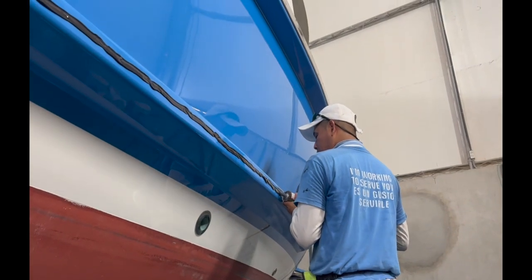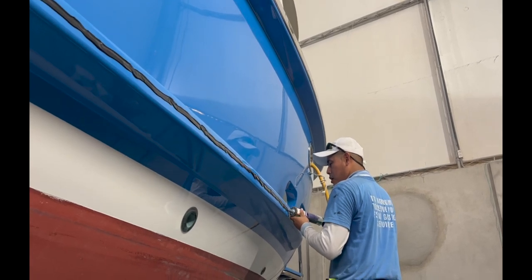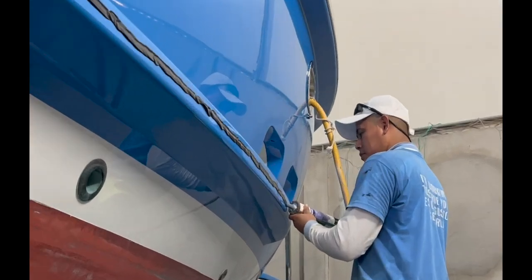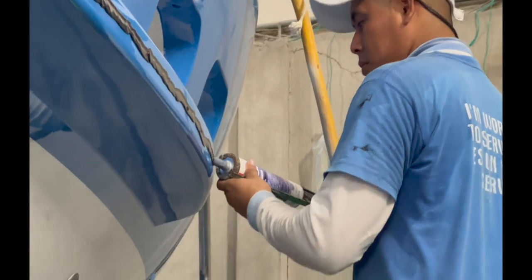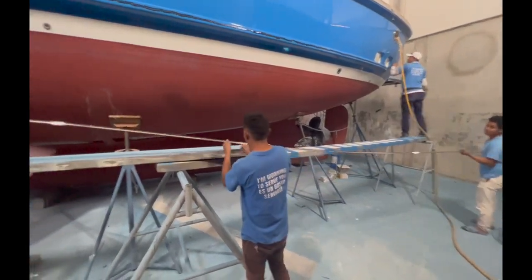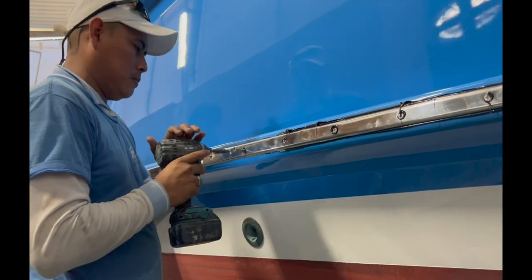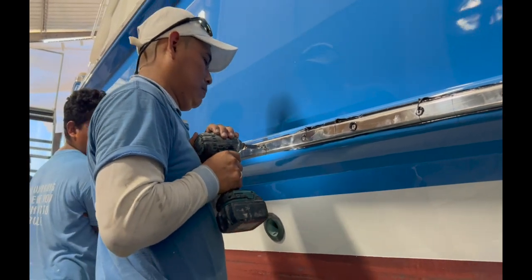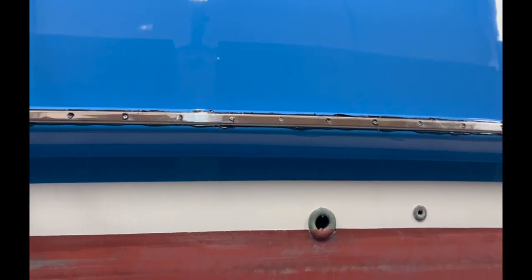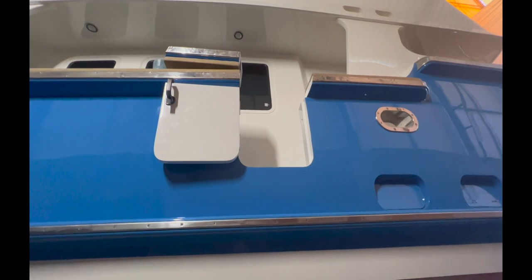Of course, once the painting is finished it's time to put all the hardware back together, including putting the rub rail metal in and 130 new screws — all stainless steel, I might add — with adequate sealant. I was very particular on this point. The sealant gets squeezed out as they drill in the screws, but it gets nicely cleaned up afterwards. Here you can see a brand new rub rail looking fantastic.